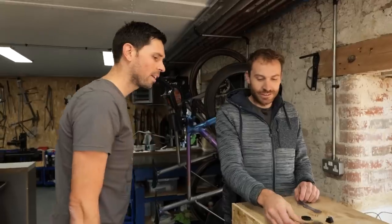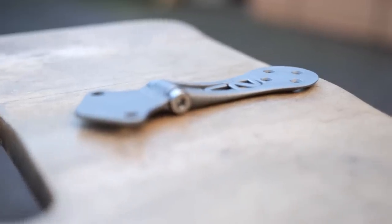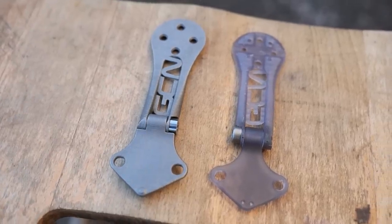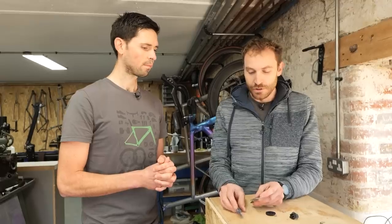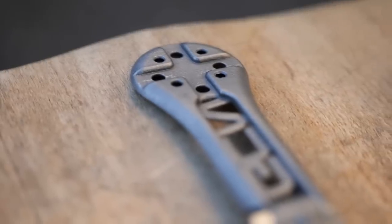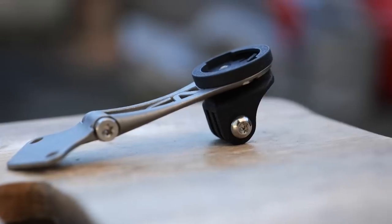Good to see you. I reckon it's been a couple of months. Look at this thing - the real thing. This looks incredible. I can't believe how light it is. We've hollowed it all out, which is something we didn't do on the plastic version - it almost feels as light as the plastic version. We've adjusted a couple of little bits on the back unit, the bit that bolts to the handlebars, made it blend in slightly nicer to the bit that holds the computer, and also stiffened it up using a couple of features inside and then a rib on the outside. These are the little pieces that we need to add on afterwards - this will work with your Wahoo computer and we've got a fitting that will hold a light or a GoPro camera underneath.